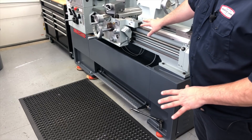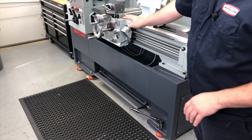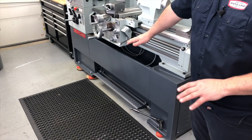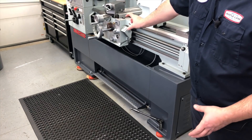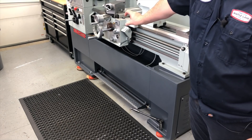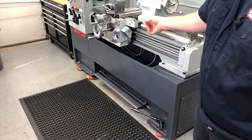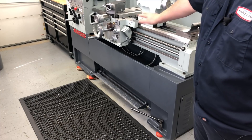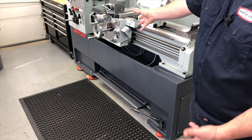When the riggers delivered the machine, we kind of roughed it out. We set the jack screws — we lifted them up on one side and pushed them down on the other to compensate for the big dip I have on my floor, because it's pretty significant. On the lower end, because the jack screws are only a certain length, I put some polycarbonate drops underneath. I did a tensile strength lookup on the polycarbonate, and it's somewhere around 7,000 pounds per square inch. The whole machine is 3,600 pounds total, so one-sixth of that — I think we're going to be okay.